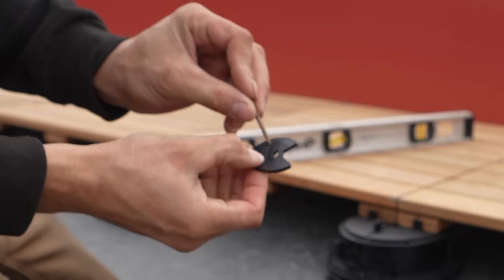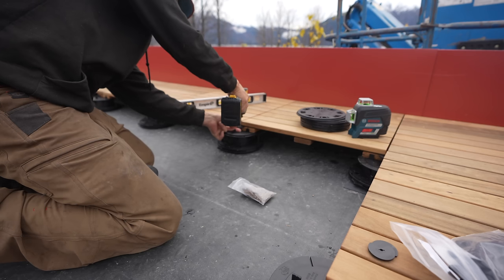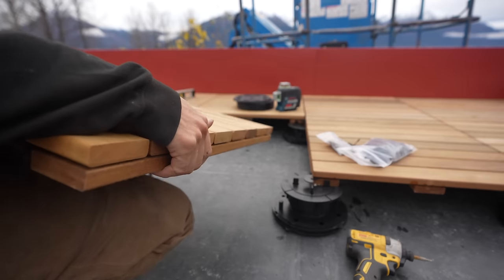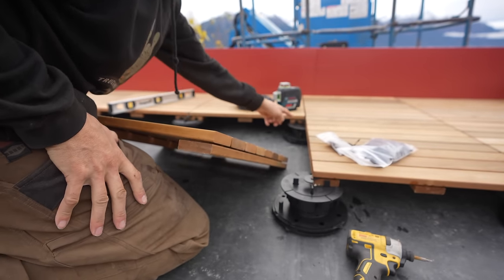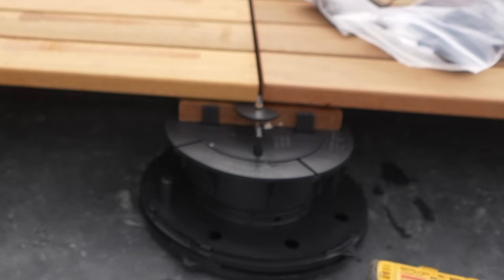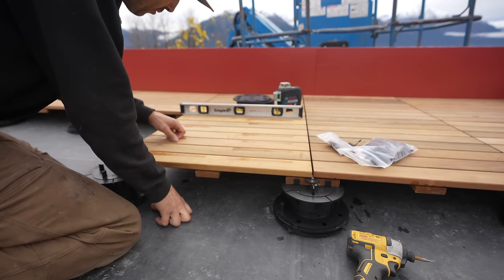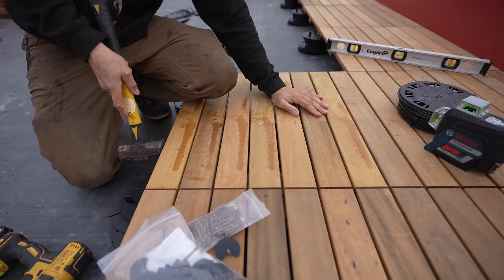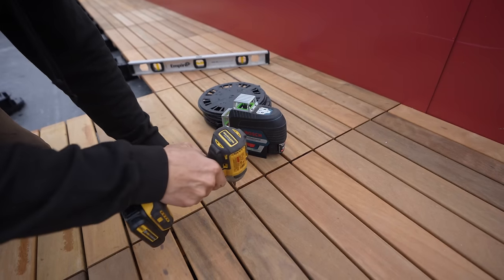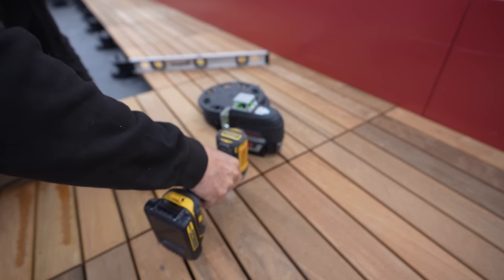I've got a washer and screw — put that onto the pedestal, slip the washer up under these two. Now go get the wood tile and slip it up into the washer slots. It takes a little shimming to get it in there. Make sure the tabs are pressed in tightly to the wood tiles everywhere they should be, check it for level — it's perfect. Give it a little mallet tap to make sure everything's nice and tight and looks square, then go ahead and sink that screw. The washer will compress all four corners here and lock the boards together.